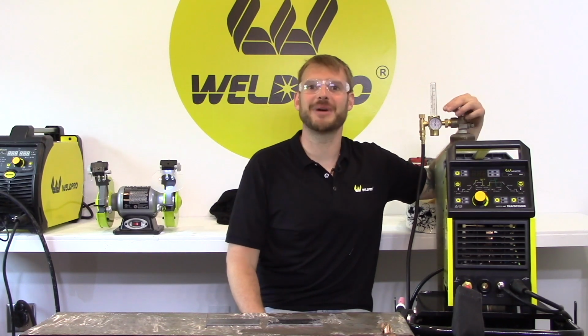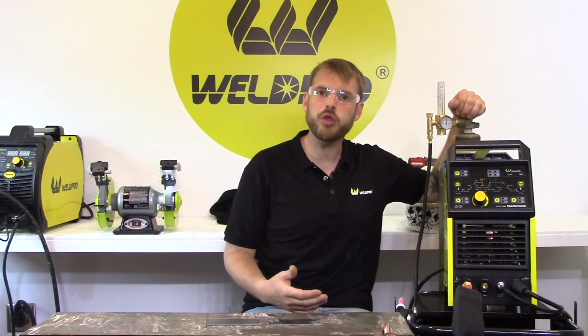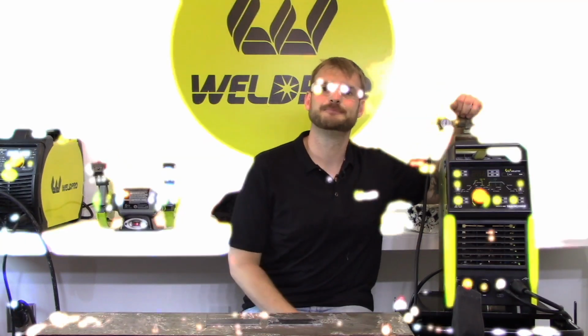Now that we're sure we don't have a gas leak, I'm going to go ahead and slowly open my cylinder again. And once again, go ahead and unscrew that counterclockwise all the way to backseat your valve.